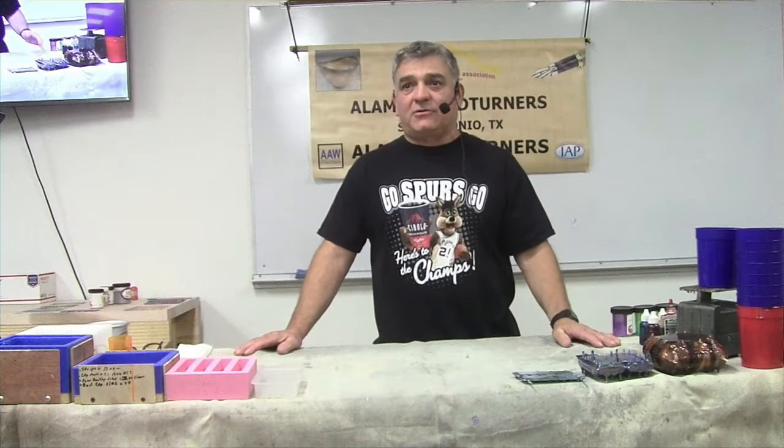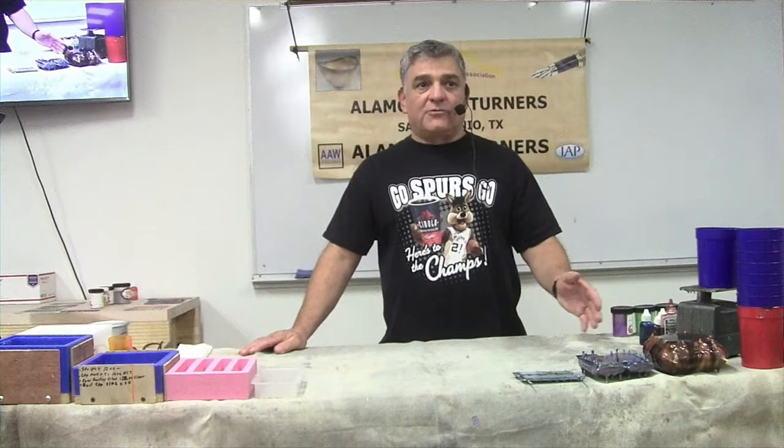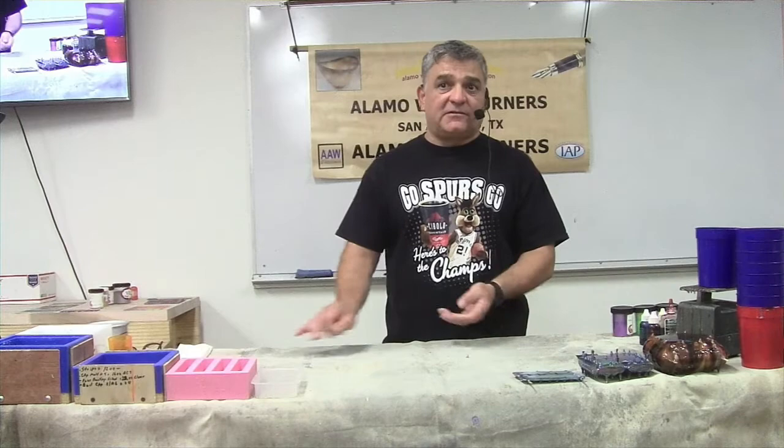If I were to do four cycles on my tanks - I have 14 active tanks right now - on a busy day I can cycle them four times each, so that's 14 times 4 blanks I can make in one day. If I were working with epoxy I could only fill the tanks once and then wait 24 hours for proper cure. So I stick to Alumilite because it's easy on my sinuses and cures a lot faster.